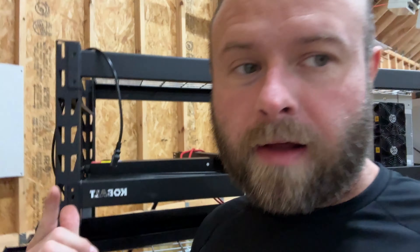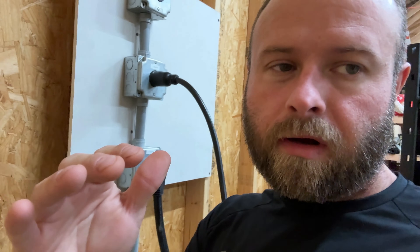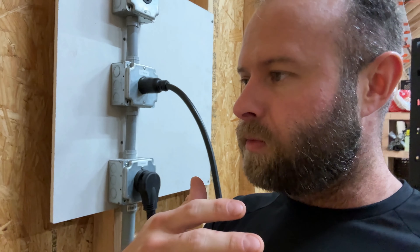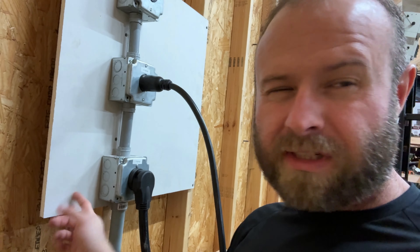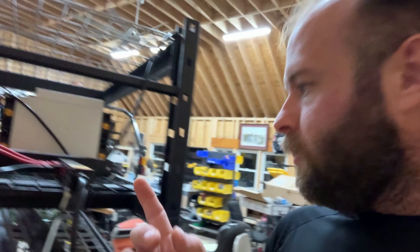We're back online. I got the fresh outlets in — I only put in one extra 30-amp, but I've got room to run another conduit and put in another 30-amp. One of my self-imposed rules: I've got to keep it under 100 amps total. 100 amps is plenty, and if I want new stuff I have to replace it with better stuff. I'll probably also put in a 20-amp 120-volt circuit just for devices that don't run on 220, or for convenience, like DC power supply connections.